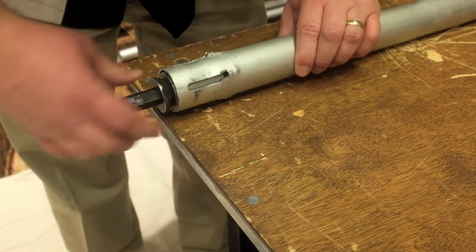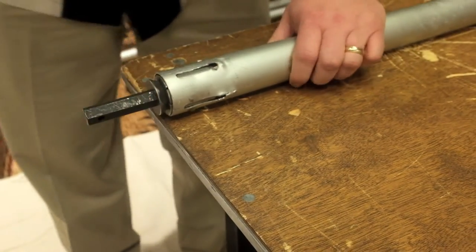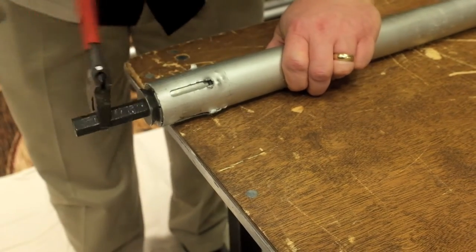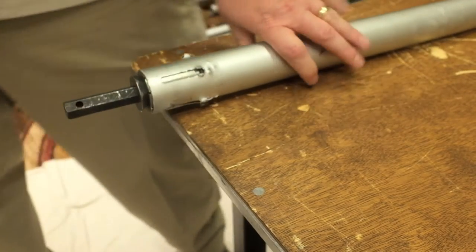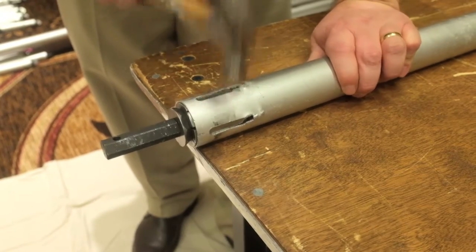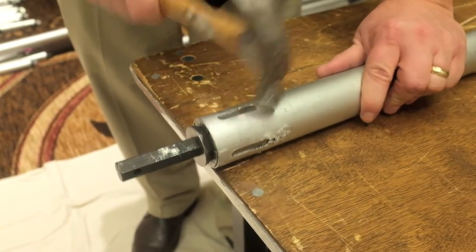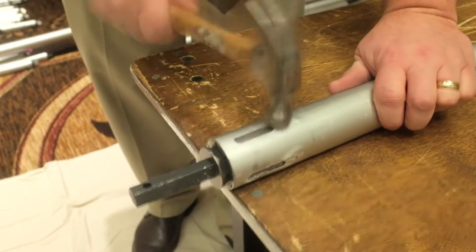For the pipes that are not so damaged and that can be repaired, we're going to use a simple pipe expander. We're going to insert that into the tube and tighten it up just a little bit — not too much. You don't want to expand the tube at all. Now we're going to take a small hammer and we're just going to hammer in all of the burrs and shards that are sticking out from the damaged areas, and basically re-round the pipe.